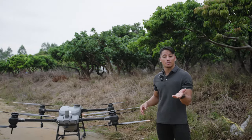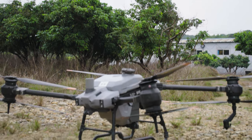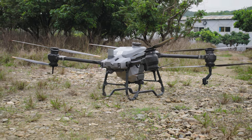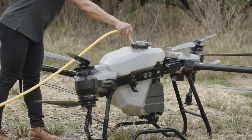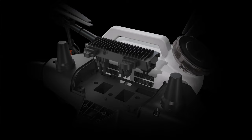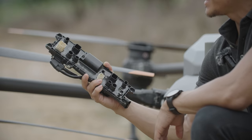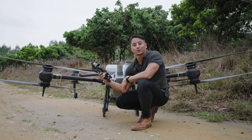Early agricultural drones have individual flight control parts mounted separately, such as the IMU, flight control compass, and GNSS. The benefits include being able to replace individual parts if broken, but it exposes the issue of water damage. Flight operations require frequent refilling of spray chemicals, so to better protect the aircraft, all the flight control systems have been placed on the avionics panel of the T40. A unitary seal has also been added for waterproofing and corrosion prevention. This glue sealing technique to the T40's avionics panel is unique in the design of agricultural drones.